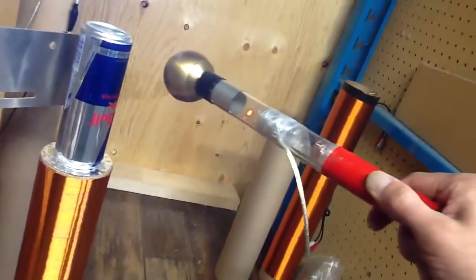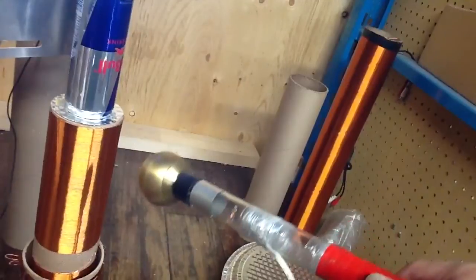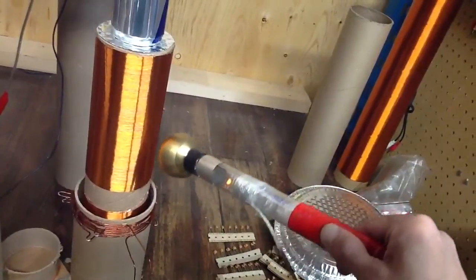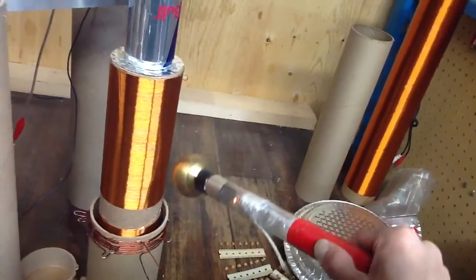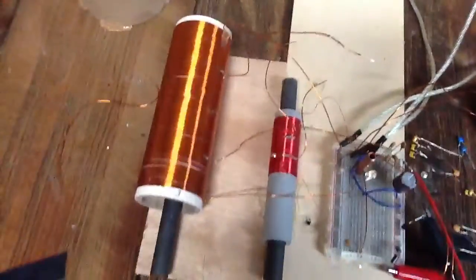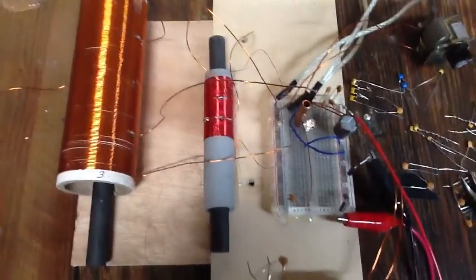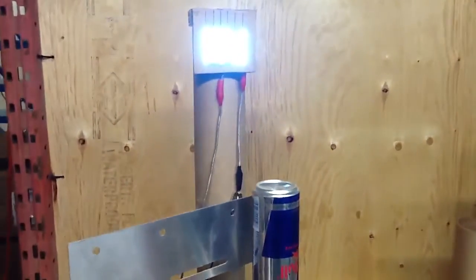This is under 10 volts, under 20 milliamps — extremely good tuning. The resonant rise going up that series LC circuit is pretty exciting. The big thing was the choke, getting it down below 20 milliamps — the choke was crucial. Had to rebuild everything with multiple taps. The capacitors were probably the most hard to figure out, but the biggest thing was the top load — choosing the correct size for the top load.